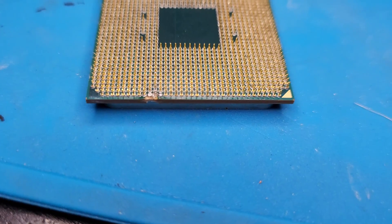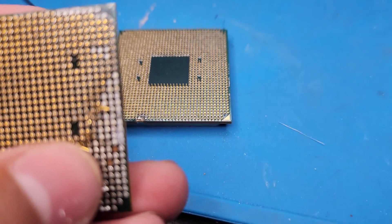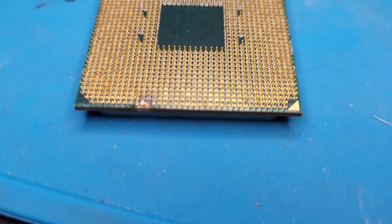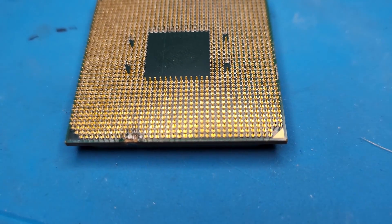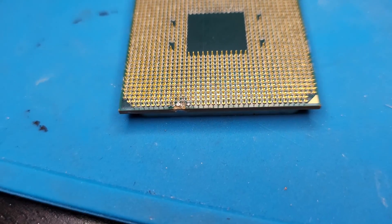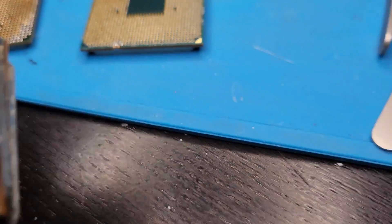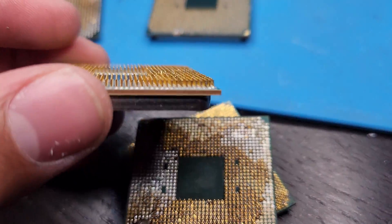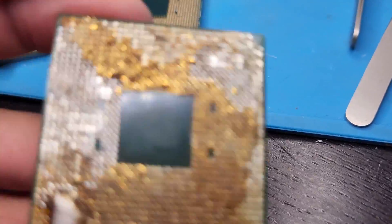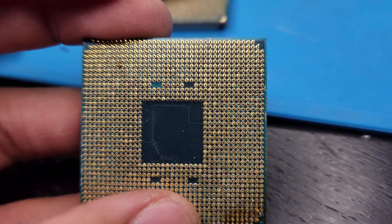Just a quick update: I tried to make a trace. As you can see on my donor, when you get to these copper points, they're basically dead — you have to dig through and trace to the copper wire. I thought I got through and tried to use some solder paste to put the pin in to connect to the wire. Not only did it not work, but I knocked two more pins off. I don't feel like going any further because I'm pretty sure it won't work anyway. If anybody knows how to repair when you get to the copper trace, I'd be very interested. This donor here started as a botched repair with 500 bent pins — I bent most back, then popped one or two. And this one also has a botched repair with a copper plate on the corner. So now they're all donors.